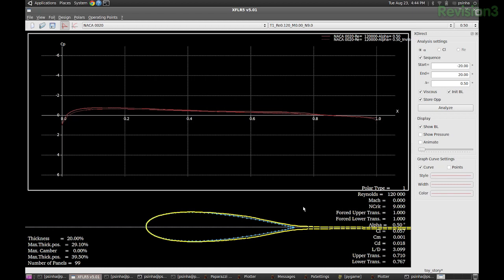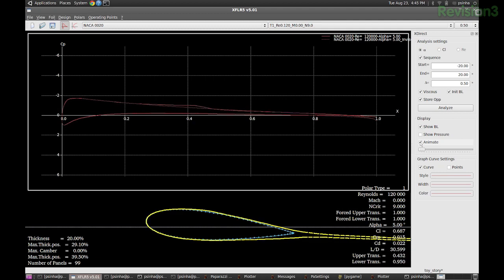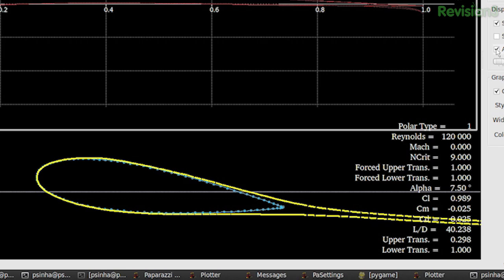How many airframe iterations did it take to get to the perfect one? This is the 8th wing and we've pretty much frozen the aerodynamic design at this point. We started off designing the airfoils themselves — the 2D sections — using programs called Xfoil and AVL, written by Professor Mark Drela at MIT. And there's a front-end version that another gentleman wrote up called XFLR5. It's open source — excellent front-end software for Xfoil and AVL — you can download it off SourceForge. After running our analysis on different airfoils, you can see the boundary layer separating and becoming thicker.